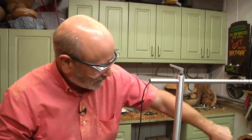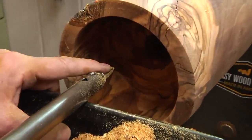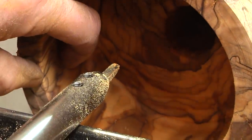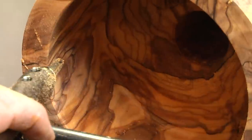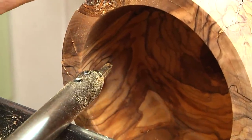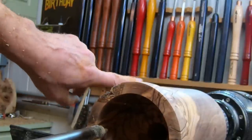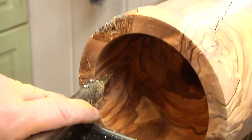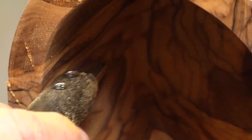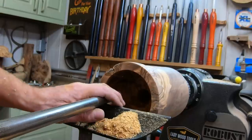The other thing, in here I'll show you, this side is perfectly smooth. Well, how did I do that with that little tip? As I go in about an inch, the last thing I do is I come back here and I take the tool and I run it straight, just like that, and I watch my laser, which is up here on top, I watch it dropping off the edge of the side of the vessel. So as I push in here, I know I'm going perfectly straight, and I do that every inch, and I just clean it up so it's straight all the way through.